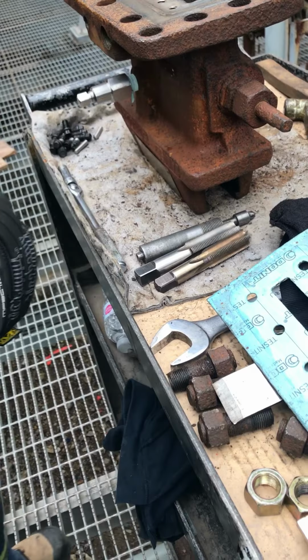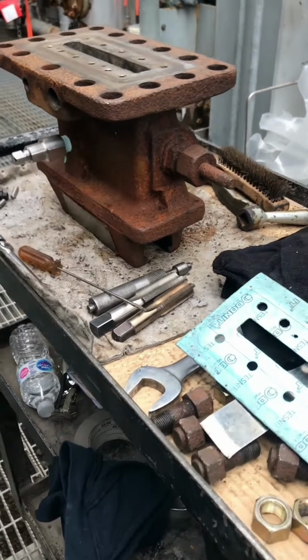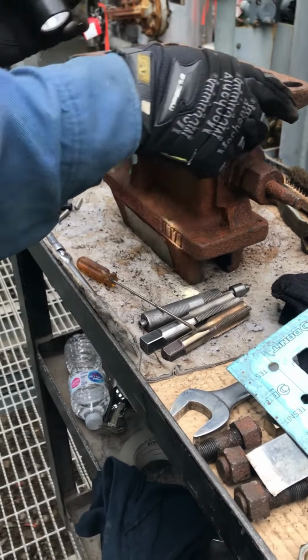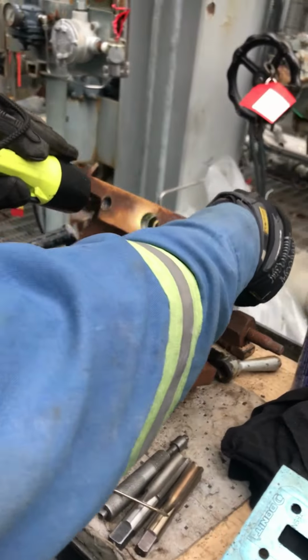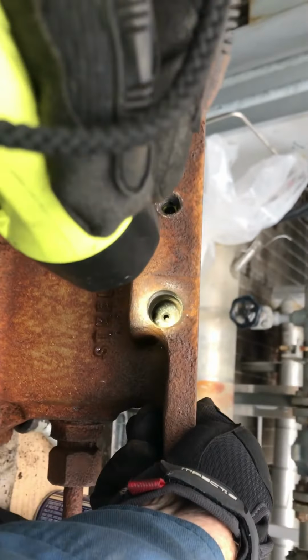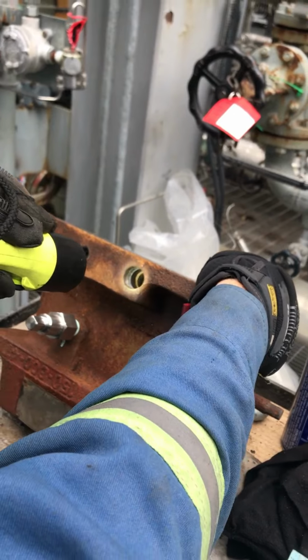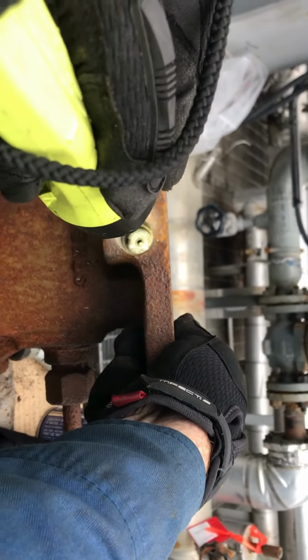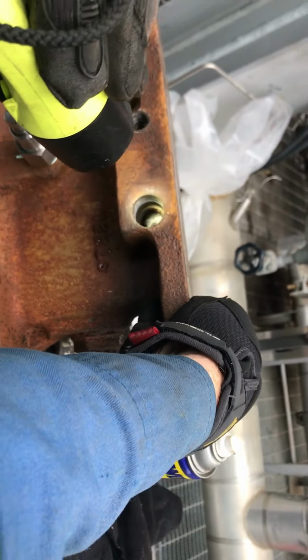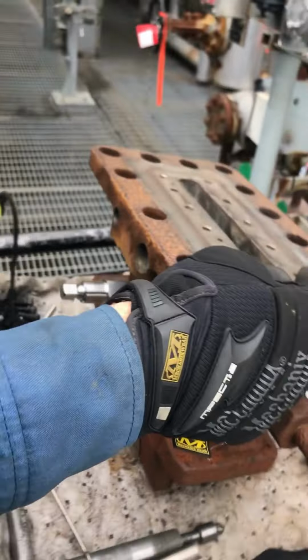Okay. First of all, what I want to do is look in there and see how the holes look. So there's where the ball bearing sits. You see that? Yep. Okay. So the holes don't look plugged. They look pretty good. But you can see that the countersink looks a little rough. It's not shiny. But anyhow, we're gonna clean out the holes just to make sure.